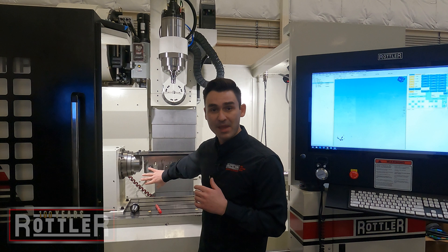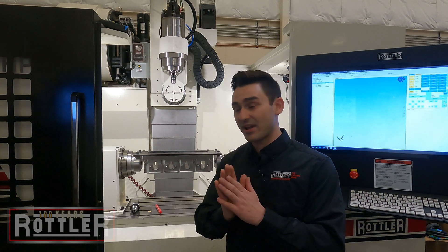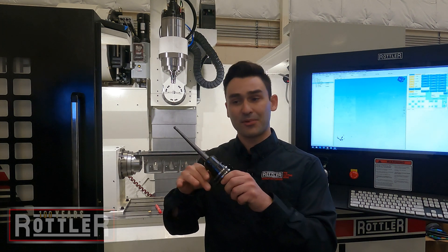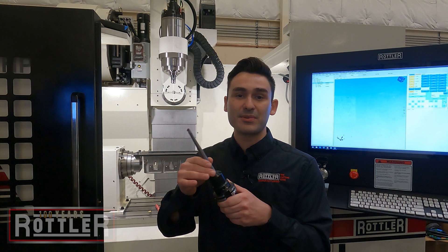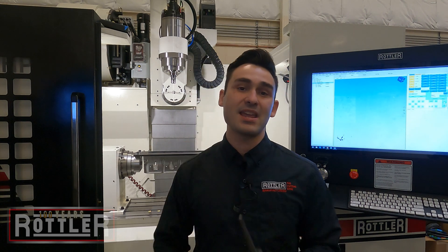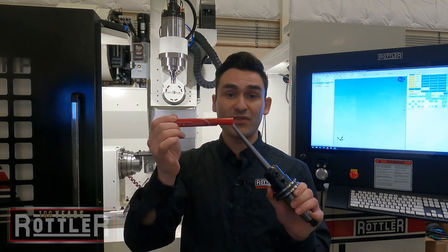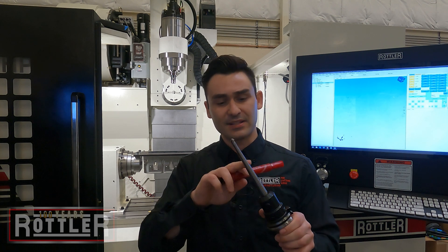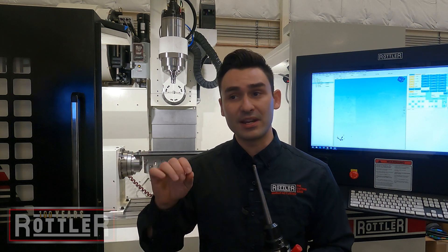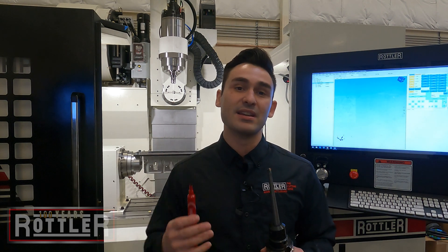For our three points, we're going to use the manifold surface, then right at the bottom of the seat, and then the location farthest we can get in there without touching the shank. The easiest way to do this process is to take a marker and the tool, stick it in there, and put your marker in from the other side. Move it around and approximate those three points, making sure you're not shanking out. That'll get you close, and when you come back and jog the probe in, you'll have three red dots as visual references.